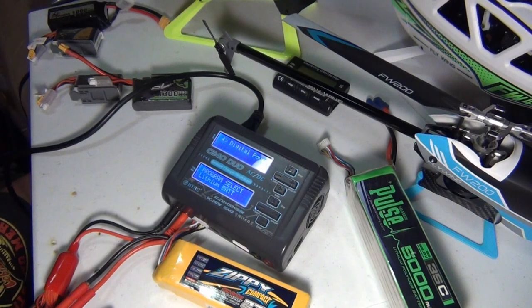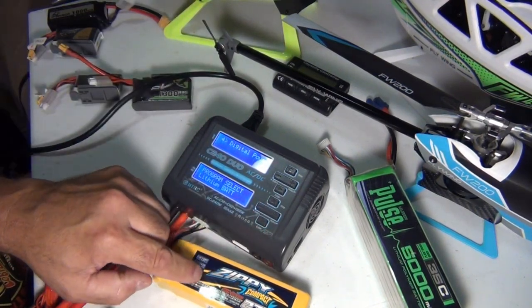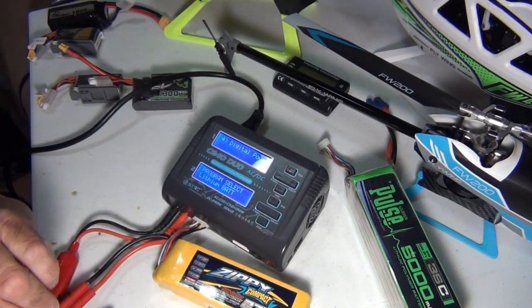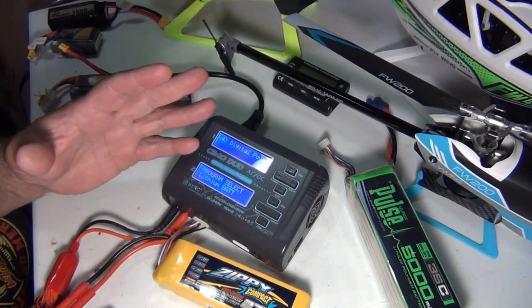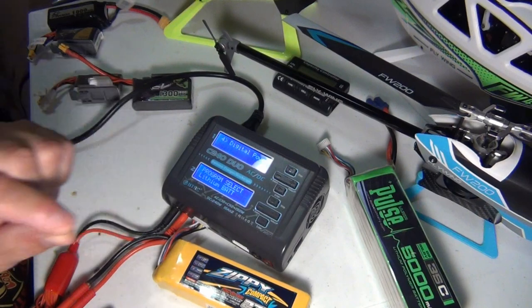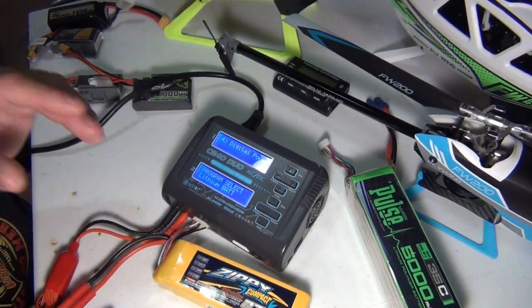You also have digital power. If you have any dead cells, you can boost power into them — this charger is not going to reject a bad battery. It's going to push power in, but don't do it a lot. Just do it for about 10 seconds, pull it off, test it, and see if the cell that's bad boosted up enough so you can put it on balance charge. All LiPos need to be at a certain voltage level before they'll start balancing — you can't have one volt in every cell and expect it to start charging. It's never going to happen.